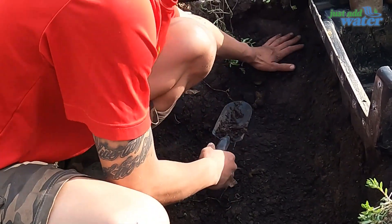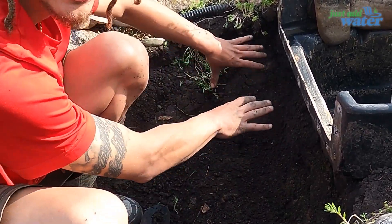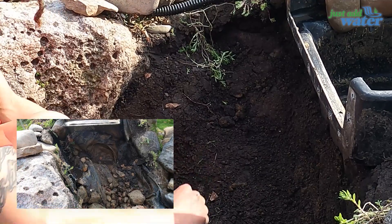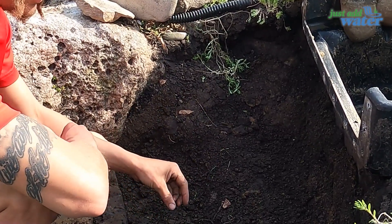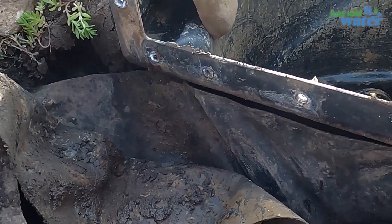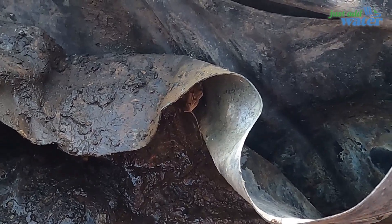Walk us through what's going on, Jay. I'm recreating my levels underneath the liner so I'll have an easier transition of water flow. A lot of the dirt was stacked up over here, causing water to flow the wrong way and go over the liner on this side. So I pulled the liner back, pulled that dirt away, and leveled it out — made a little shelf, about a two-inch difference, just to keep that water moving south. I've got some rocks here covered with dirt for a little protection. I'm gonna flop this liner back and reseal it onto the biofall. Now that we have the old faceplate off and everything excavated, we've figured out our liner situation — this is the original stream liner, this is the new one. We're gonna make sure this one is high, and then our new liner will be high until we get down to this next waterfall.